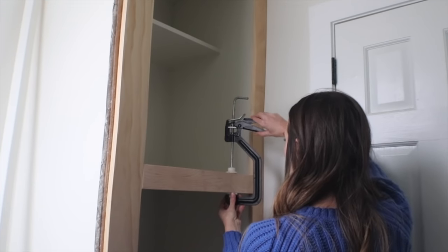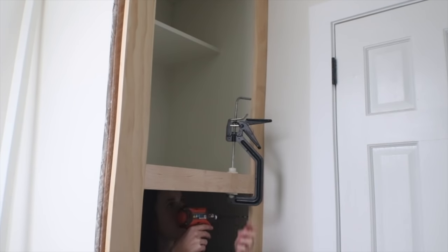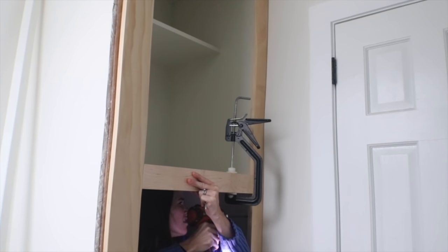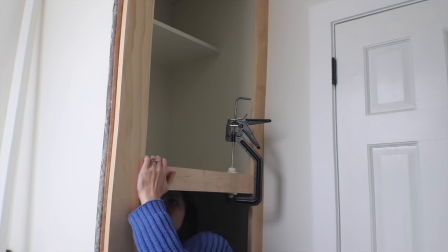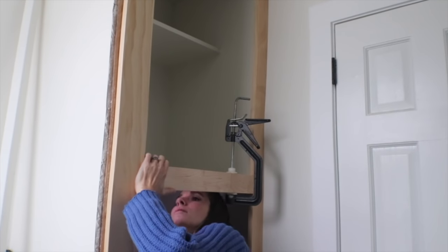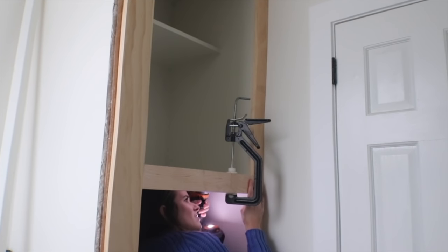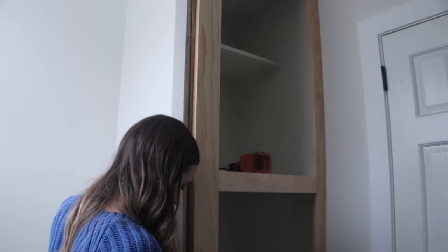To install the face frame, the first thing I do is clamp it into place by pulling it flush with the top of the shelf, then I screw in the Kreg screw that lines up with the wall stud. When I was planning the dimensions of this closet I intentionally lined up the face frame so that the side on the right — where there's a thin piece of select pine — could get screwed into the wall stud system and have enough support for the hinges and doors. I also have Kreg holes to screw in underneath the shelf that pull the face frame tight to the front of the closet.